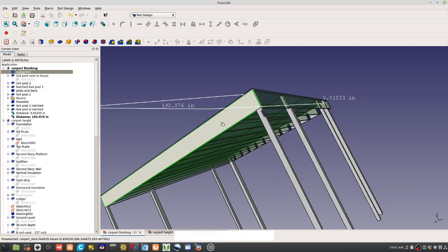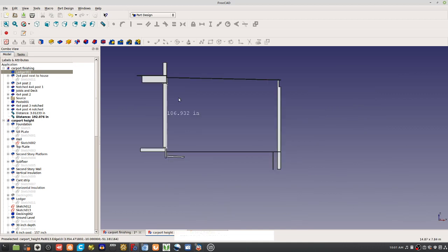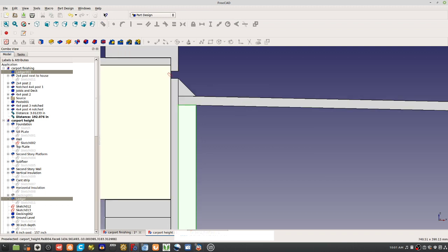4.5-inch lag bolt. So this is attached to the house at exactly the correct height, which is here. That's the correct height right here. We can read this exactly. So the easiest way to read it would be, I believe, to measure from the bottom of the siding, and that should be like 3 inches or so. I believe that's going to be from there to the top of the board. It's about 3 inches, so do it 3 inches.